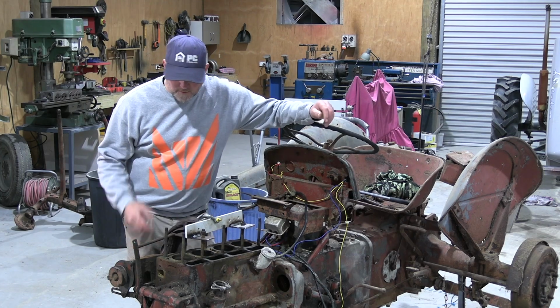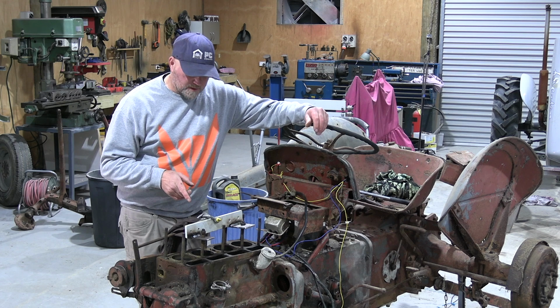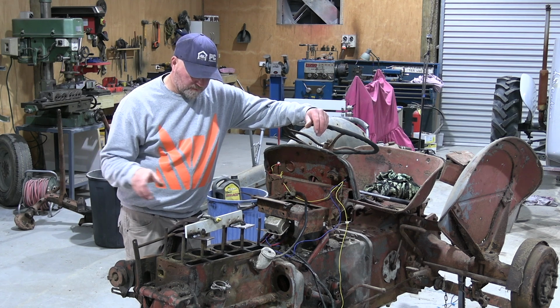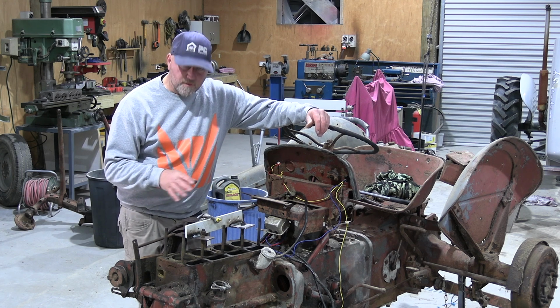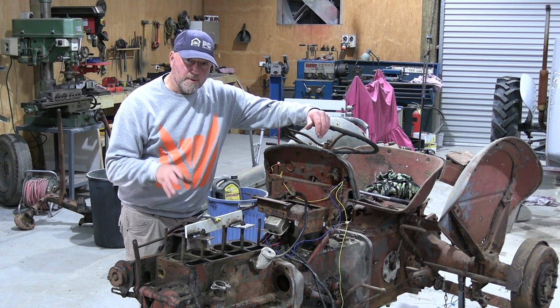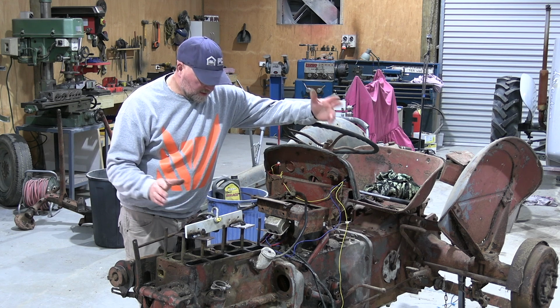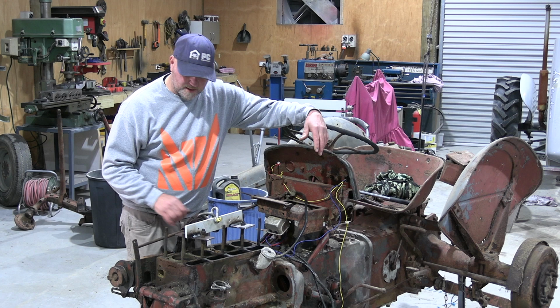So in this video, I'm going to be removing the engine, sticking it on the engine stand, flicking it upside down, pulling off the big end caps and mains, having a look at the shells. I'll be popping the pistons out one at a time, see what the bores are like, possibly giving it a hone. DIY pretty much, so DIY engine strip and check.